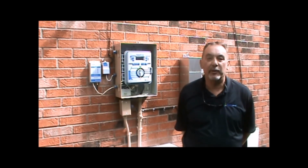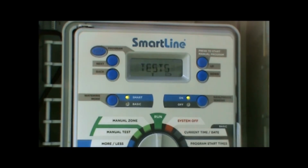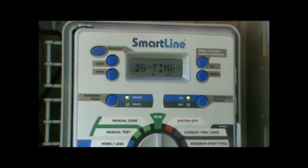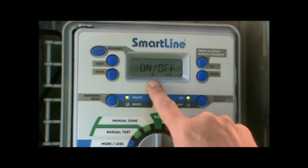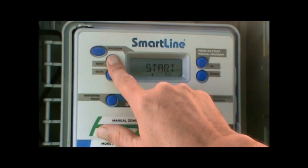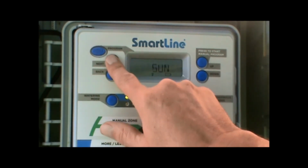Next up under review gives us the ability to set daylight savings time by day and by month. In the Advanced menu, press the up button until you reach daylight savings time. This feature can be turned on or off to match your need. The ability to alter daylight savings time schedule has been provided to allow for future changes in the schedule or to match your specific location's needs. The default daylight savings schedule has been set to match the current United States schedule.